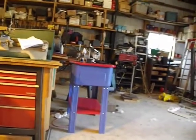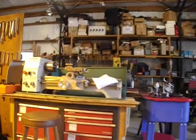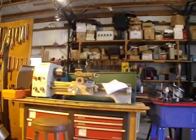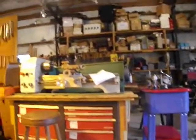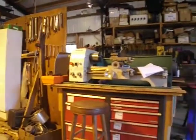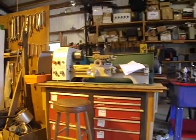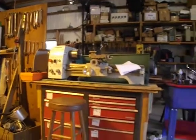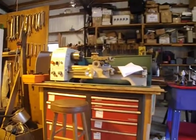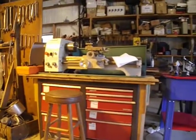That's my shop today. I'm going to do a little bit more rearranging, cleaning, getting things put away and squared away, and then I'm going to tackle cleaning, lubricating, and doing the break-in procedure on this lathe. I don't plan on cutting anything or doing any feeds and speeds, though I do plan on running all of the speeds available on the lathe for at least five minutes, after I've refilled the oil — because in the process of getting it up here, I spilled just about all the oil that was in the reservoir. So I've got to refill the oil, which fills on this side and dumps on the other side. I need to put together some kind of emptying port. Anyway, that's tomorrow. I am done for the day.